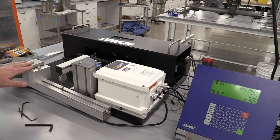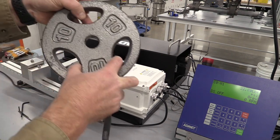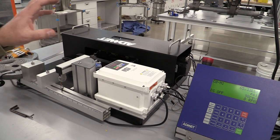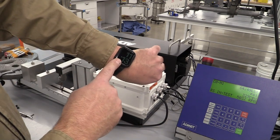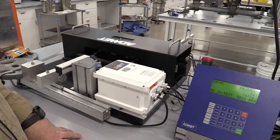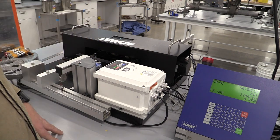I'll do my final adjustment to reach 65 pounds. I need to put the safety strap on the weight so it doesn't vibrate and pull off — go around the yoke of the weight and around the beam and make sure they're held tight so it doesn't slide off. We now have our weight set to 65 pounds and we're ready to start. Hit the start button and it will begin capturing revolutions. Also record the time you started, and record the time to failure once it stops and breaks. If it doesn't stop automatically, hit stop to stop the motor.